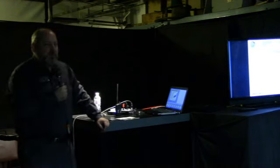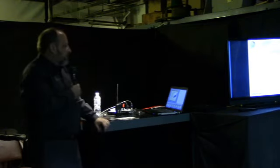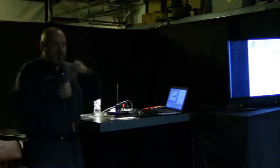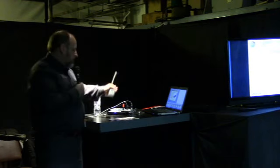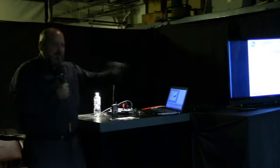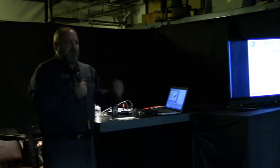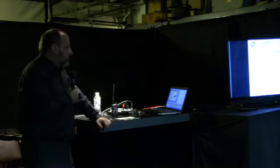Here's that DV access point. These guys, it's got the little tiny antenna, but it's an SMA connector. You can put a little larger antenna on it. This is a VHF thing. You can put it on a simplex channel and talk to it. And it gives you the ability to use your standard DSTAR radio with this device plugged into a laptop or desktop, whatever, and generate some amount of DSTAR coverage around your house, around your vehicle, around a room, whatever. So we could plug one of these things in here and put it on the air.